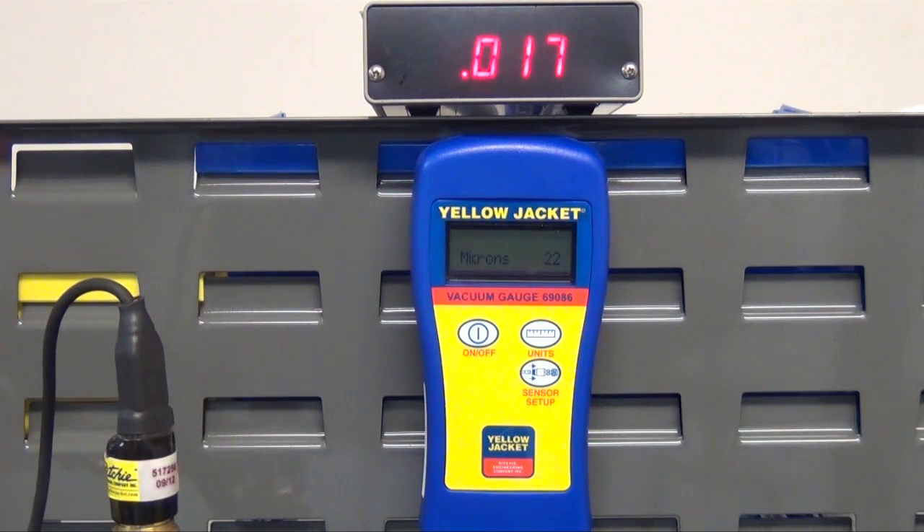These vacuum gauges are highly accurate and will indicate any molecular activity. Even if you're running straight off a vacuum pump, there is still water vapor, possible contaminations in the oil, and molecules from the interior of the pump. There will also be outgassing of the rubber hoses or even from the ball valve or isolation valve.